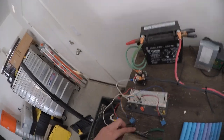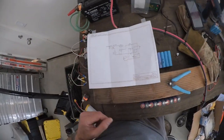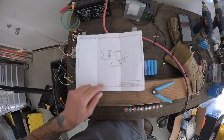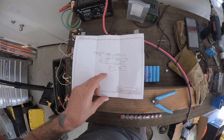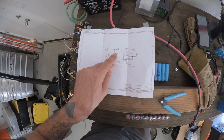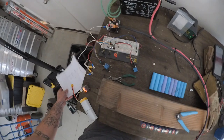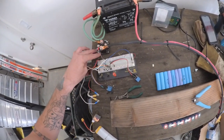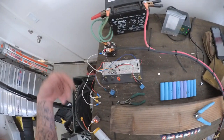As we can see, this is the standard circuit as published — here is the wiring diagram, credit where credit is due. The only thing we really changed was this portion of the AC circuit. Instead of having this relay directly power the AC circuit, we had this relay actually trigger another relay that is carrying the full load from the 12 volts. That way this contactor, because it is a heavy load contactor, actually needs that full 12 volts being supplied to it.